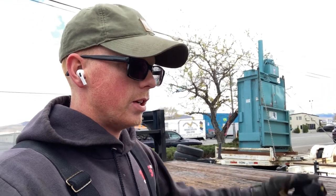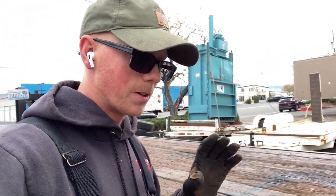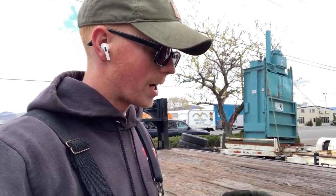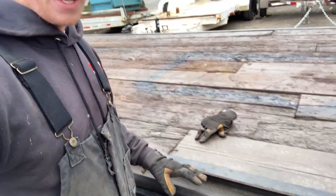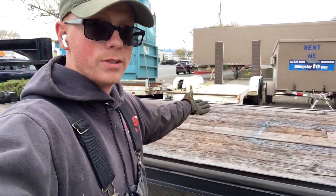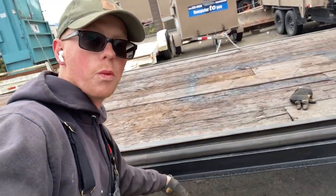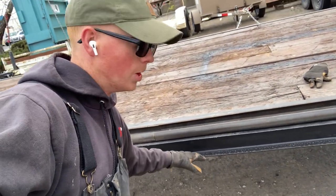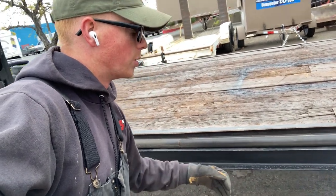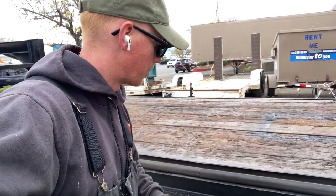So, in case you don't know what that is, to paint the picture for you a little bit, you'll be able to see once I'm all done what it actually looks like. Basically, you have your 4-inch straps, which go across. They hook on the far side, the strap comes across, and it goes into a winch that's mounted to the trailer on this side. And then you use your little bar to tighten the winch. You feed the strap through, you tighten the winch with the bar.